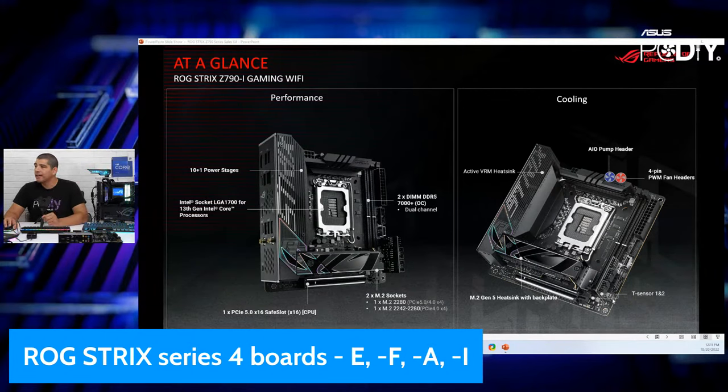We have also gone ahead and integrated the temperature sensor. There's actually two temperature sensors. So I know that some people wish that we had the temperature sensor in Z690, and so I worked really hard with our team to push to make sure that we reintroduced it for this generation for the small form factor community, especially those doing closed water cooling. So no worries. If you weren't happy that it didn't have it last generation, we have reintroduced the temperature input sensor for this generation, right? So you do have that on the card as well. And then you have, of course, your internal USB-C header and your USB 3 that is also going to be present on this board, okay?